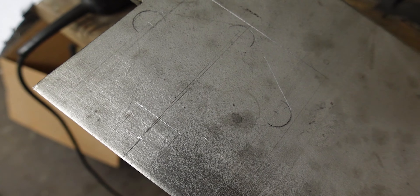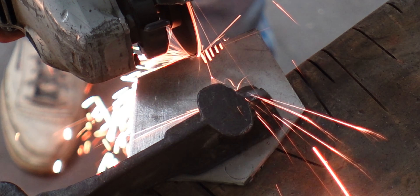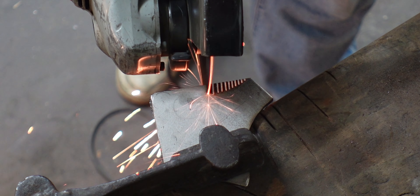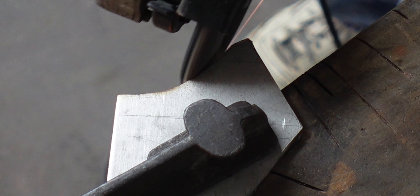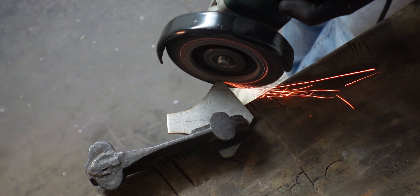After moving the position of the lamp a bit forward, I copied the design onto a piece of 4mm stainless steel and started cutting it out. On the new design I had two big radiuses, and when cutting these radiuses it can actually be helpful to make a lot of small cuts and then cut away the little fins that are created before moving on to the flap disc. That way you remove a lot of the bulk material before starting to grind the final shape.